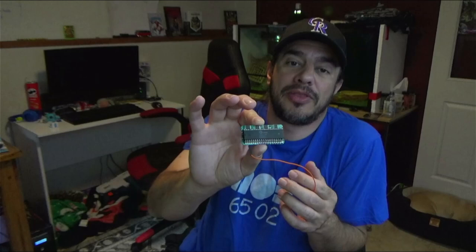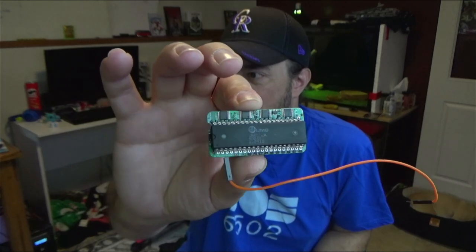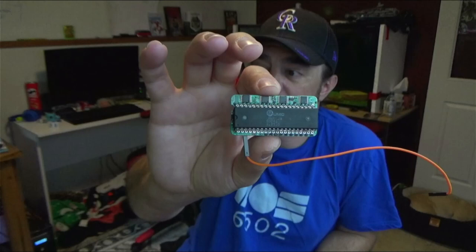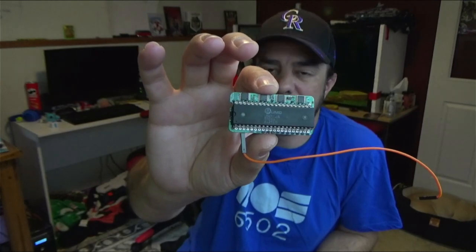One other thing we'll show you is this adapter board — it comes out of a guy here in New Zealand. I bought this while I was still in the States and brought it back. I'll put a link below to his store — super nice guy, very responsive, helpful. The little adapter board essentially adds the missing logic to the 6502 that makes it a 6510. So without further ado, let's stop rambling and get into some of the technicals and things I've learned along the way.